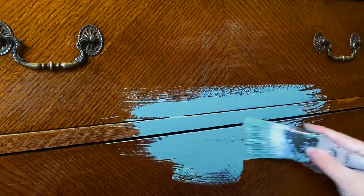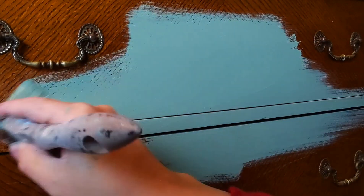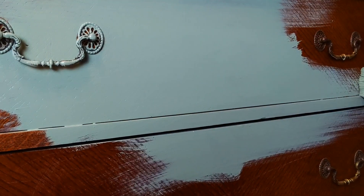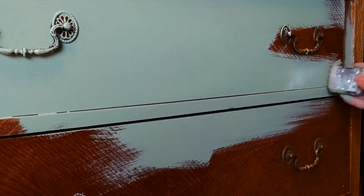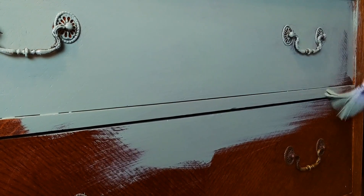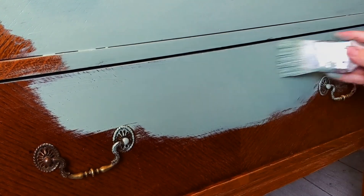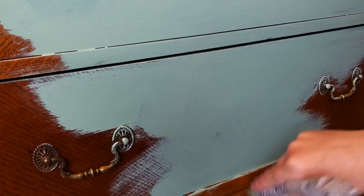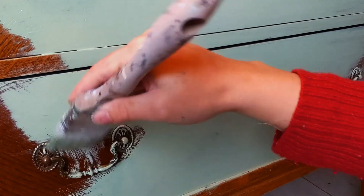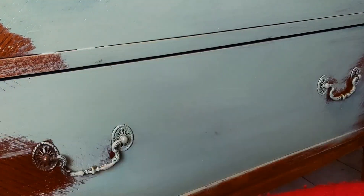To get started, make sure that your piece is thoroughly cleaned. I like to clean my pieces with White Lightening or a very good TSP. More often than not I like to apply a base before I do anything to a piece — it's kind of like my priming. Here I have a mixture of Kudzu and Dried Sage, both by Dixie Bell, in a 50-50 mixture, and I am applying it all over this piece. The brushstrokes are all over the place; I'm not too concerned about them right now — I just want good coverage and I want to make sure it settles into the grain. I'm not adding water at this point because I want the paint quite thick, and I am also painting over the pulls for this piece.